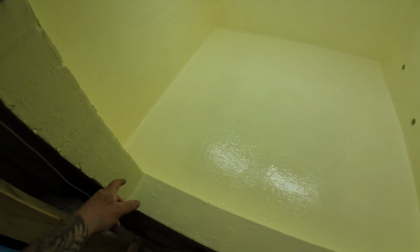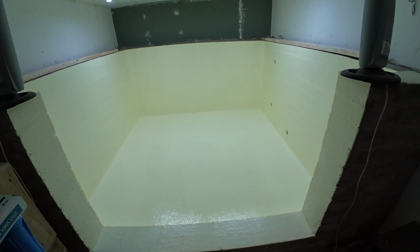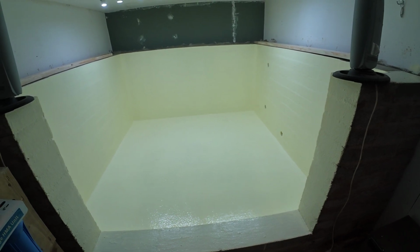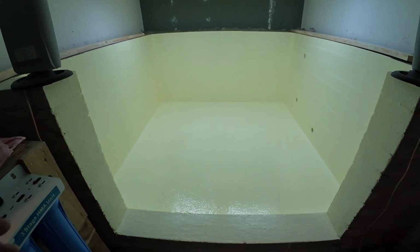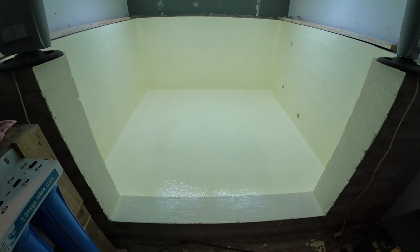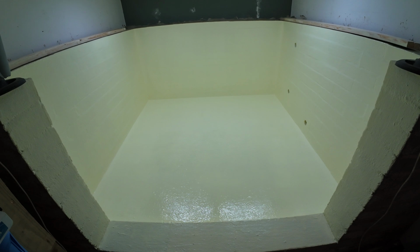Like I say, with the condensation, it literally holds water. I've seen literally water on the floor. So if you do use this pond paint, don't use it later on in the day. If you use it later on in the day, just be warned of obviously condensation with the temperatures dropping later in the afternoon. Mid-working temperature I believe is 20 degrees, but it literally goes on like you're decorating your house, with a short pile roller and a brush for the corners for cutting in, and it says an hour and 15 minutes until it's unworkable.